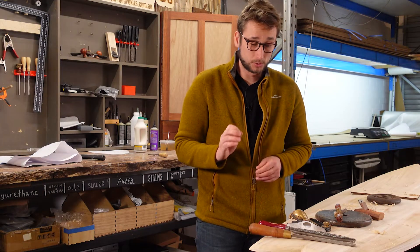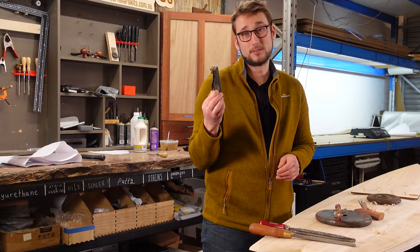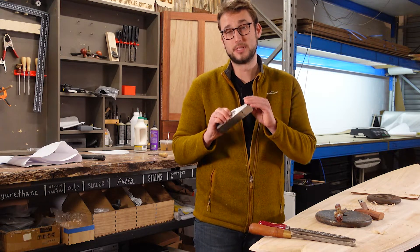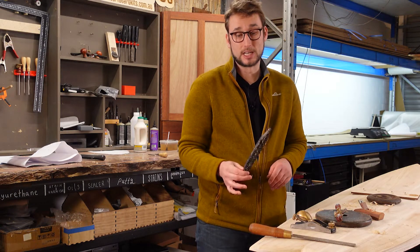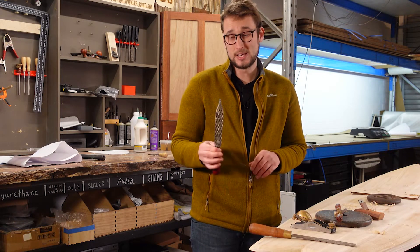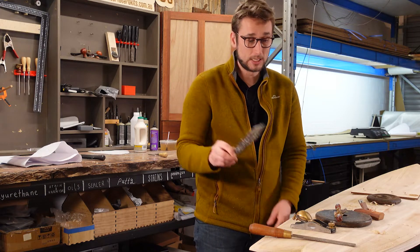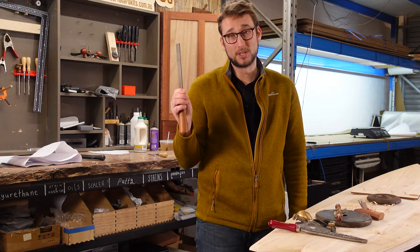Now you're only going to need a handful of tools to shape your board. A small hand plane or a block plane like this is going to be the real workhorse as this will remove the bulk of the material. On top of a hand plane you're also going to want a rasp. We use a few different styles here — this looks fancy but it's just a standard Japanese style rasp, but a more traditional western style rasp is going to be just fine.